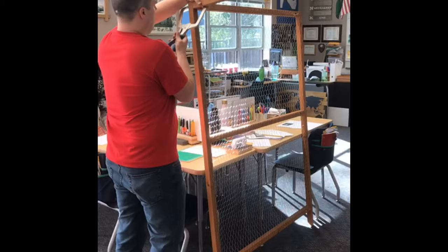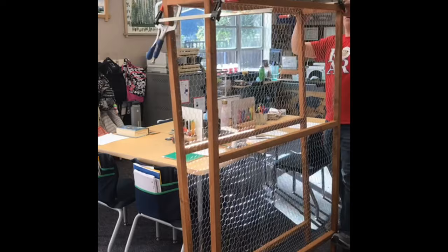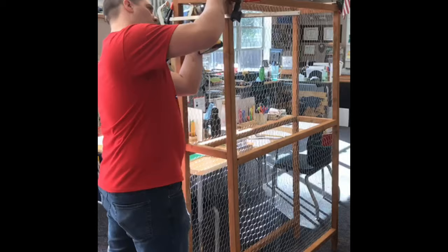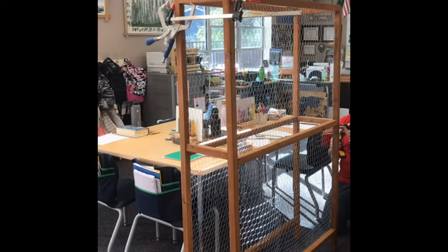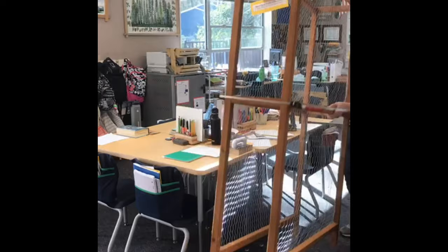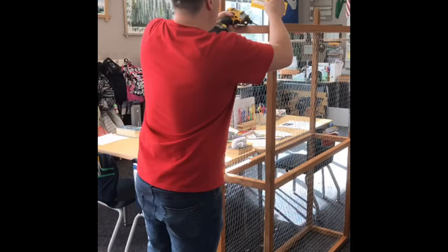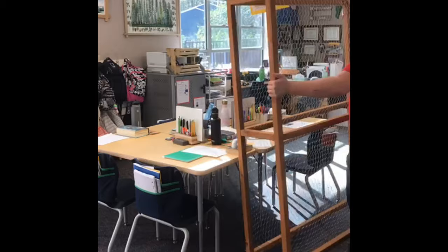Assembly time. This style has two different panels, which makes it a little bit stronger — it's not going to tip as easily as just a single one — but also it gets you more yield since you can grow on either side of it. I'm just using some more of these pieces with pocket holes and drilling on the underside to get it through. When you're attaching pieces, it's always good to have good pressure, and if you're able to clamp it, that much better. Flip it on over and get those spacers in between.